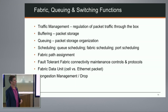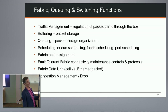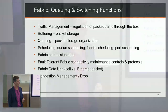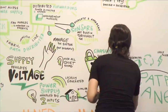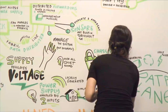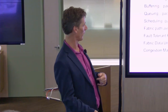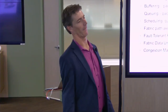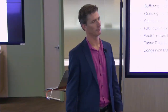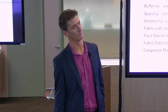A lot of energy has been put into fault tolerance. It's not too hard to test failure cases with idle systems, but to do it under loaded conditions repeatedly and ensure everything stays up takes significant engineering. For QoS, the hardware supports a range of modern flexible queuing algorithms including weighted round robin and weighted fair queuing. There's a lot of flexibility in what can be provided.